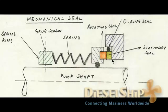So you have three important seals here as we discussed earlier. One is the primary seal, which has the sealing surface over here, that is between the ceramic layer and the carbon layer. You have a seal which is primary, and you have two secondary seals. That is one secondary seal which is the O-ring for the stationary part, and one O-ring for the rotating part.